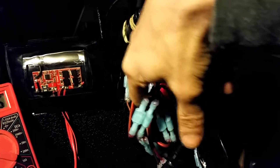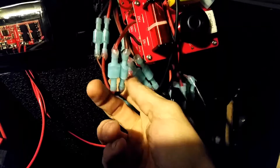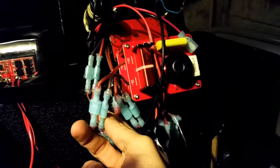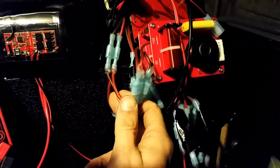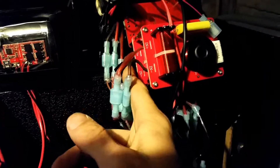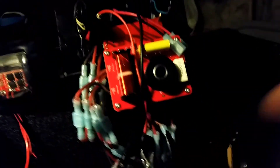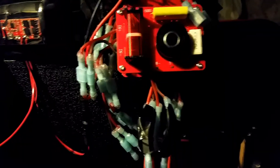Audio-wise, here's left and right audio. There's that little green terminal block — these wires are stuffed into that. Each of those left and right channels gets split here; one split goes to one of these crossovers, and the other goes directly to my full-range speaker. That repeats on the opposite side.